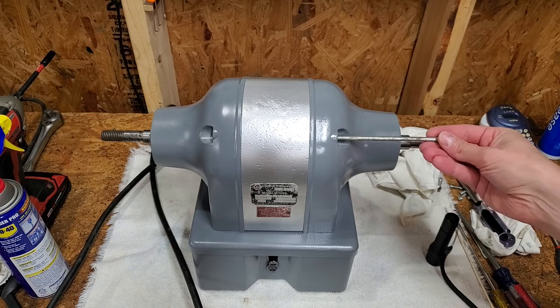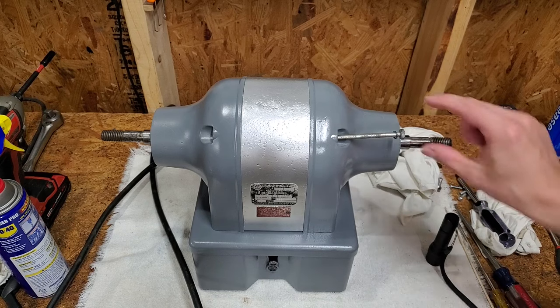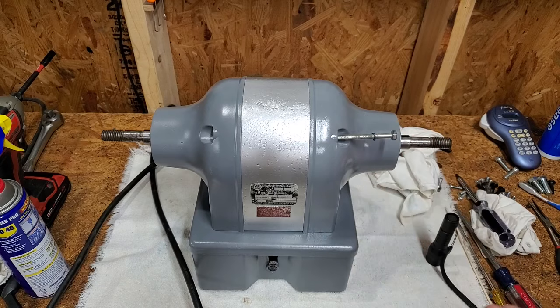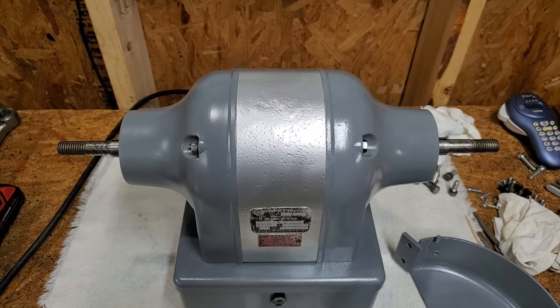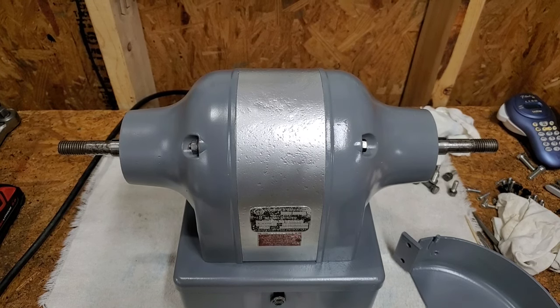Until... these bolts go through holes in the stator housing, and I failed to make sure they were perfectly lined up when pressing the pieces back together. I had to disconnect the wiring, remove the base, and rotate the two outer covers just a tiny bit, and now all the bolts are in.